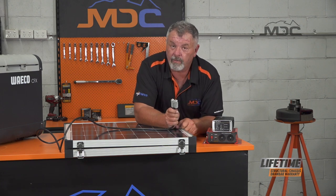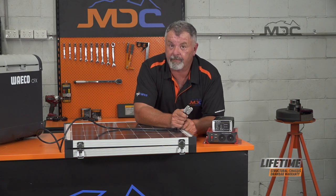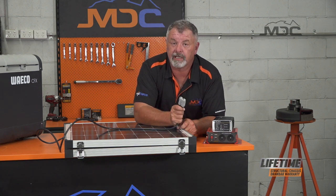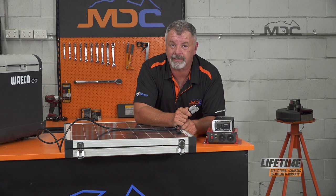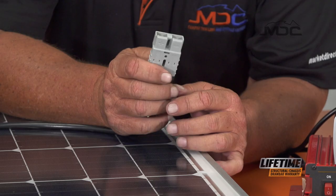However, that won't work on your Robson XTT, because that has a DC-to-DC charger and the Anderson plug on the drawbar is purely for drawing power from the car. If you want to add solar panels to your Robson XTT, there's another video you'll be able to watch to explain how you do that efficiently, but generally on your camper this will do the job.